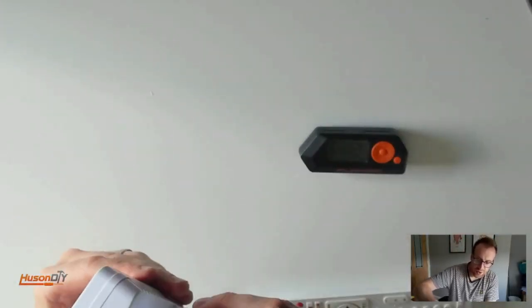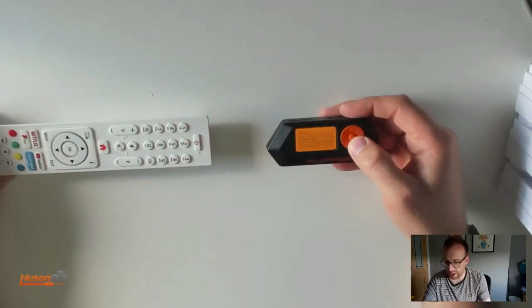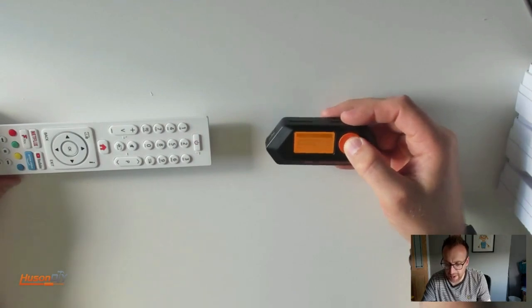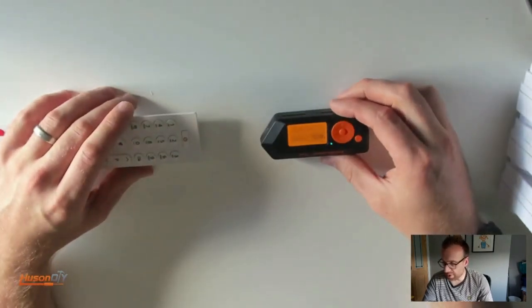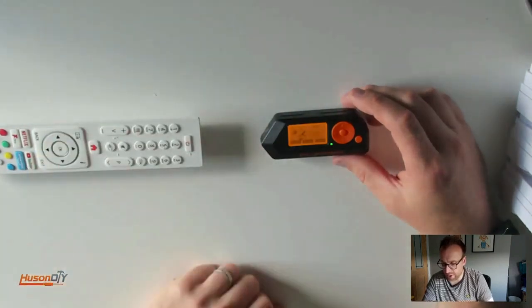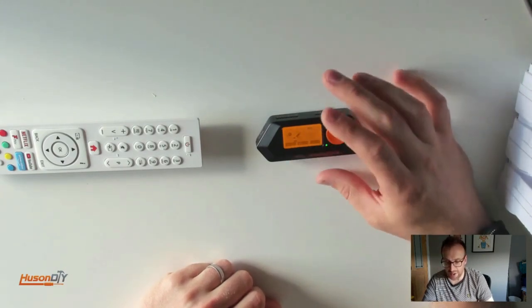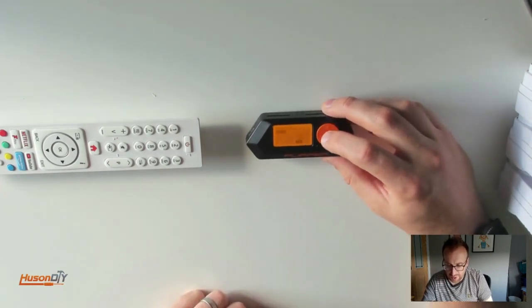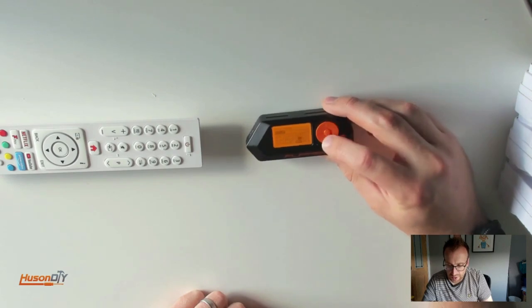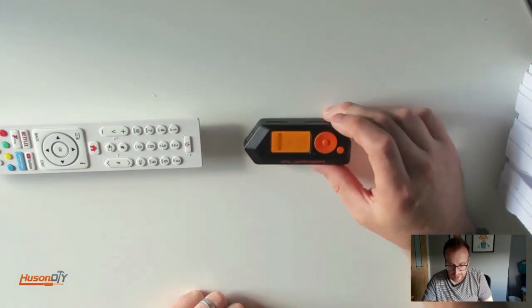On the Flipper, let's go for it. Go down to IR because obviously the remote control is IR. You've got the universal remote in there but you can learn a new remote, so I'm going to do 'Learn New Remote'. I'll put it there and press the power button — it literally beeped and got the code on screen. I can retry, send, or save. I'll save it, leave it as RC5_OC — can rename that at some point. Save that, okay.